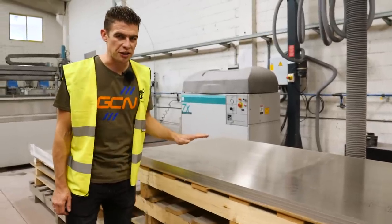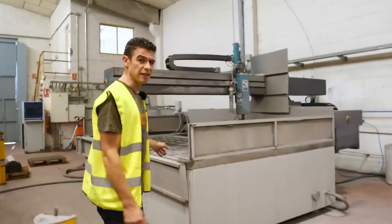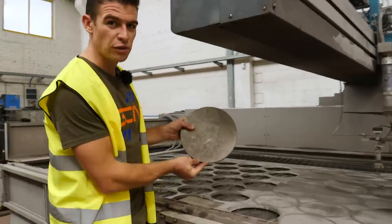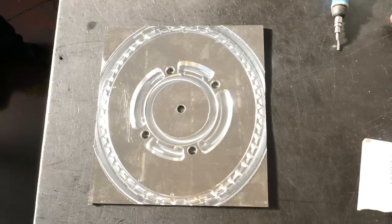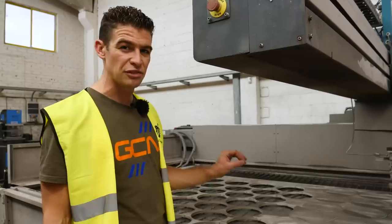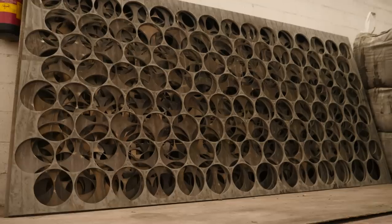I'm now inside the first part of the factory here at Rotor, stood next to a giant sheet of 7075 aluminium, which will form all of their chainrings — both round and Q-rings. These giant sheets first have to be lifted into this machine here. This is the Mach 2, named because the speed of the water jet is two times the speed of sound — incredibly fast and able to cut incredibly thick material. Round rings are formed from giant discs Rotor officially call 'cookies', and Q-rings are made from squares to minimise wastage. It takes around two minutes to cut one form, and a single sheet can yield up to 60 rings in around two hours. The sand used to cut the material is drained, bagged, and reused in building material, and the sheets are recycled as well.